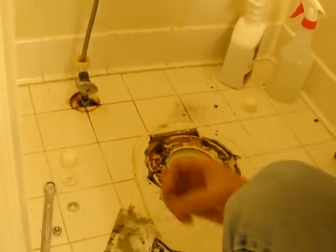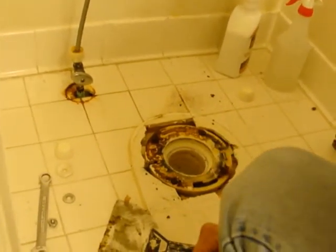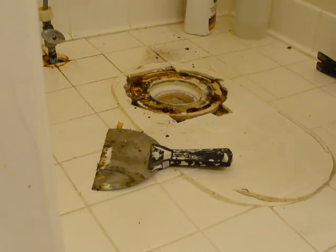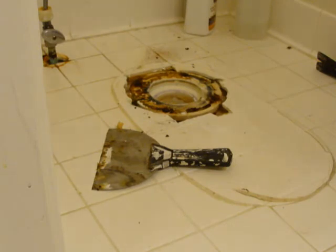Because you want it to be thick and squish out, or you want it to be custom made for that toilet. We've got to replace these screws too. You can't replace the pipe. I got an extension because we made the floor taller — the tile was taller, so I needed to extend it by putting an extension on top. When you're done with the tile, you want the tile flush with the flange, or just a little above. Ideally. If it's not, you need an extension.